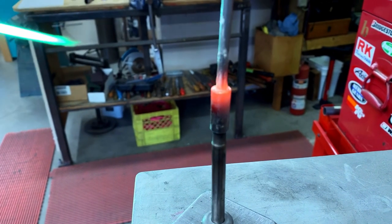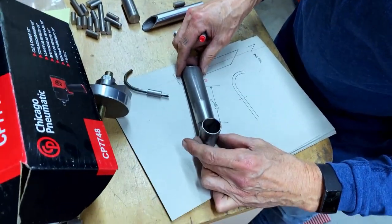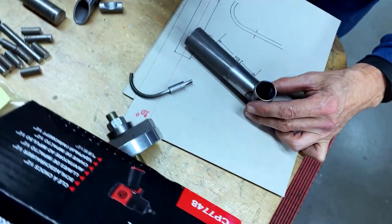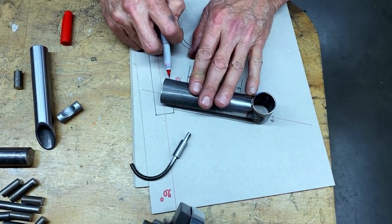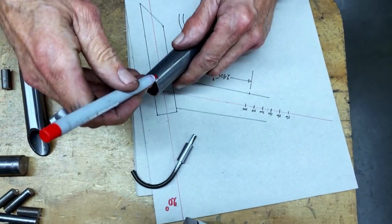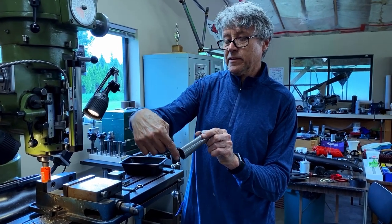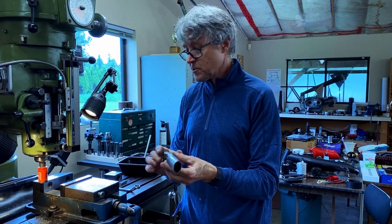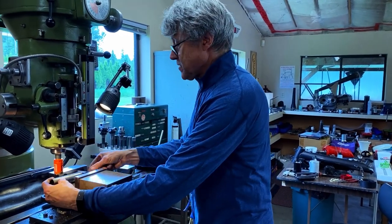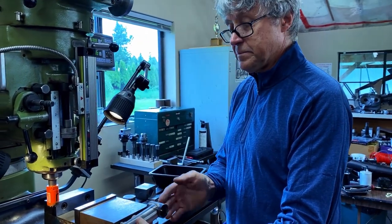And that's it. What I'm going to do is mark it where it needs to be mitered, because when I put that like that I know my angle of 20 degrees. I'll put a mark right here, in line with the front of the quill tube — that's where I want the hole saw to go. So the miter needs to be at a perpendicular angle to the clamp tube. That's partly why this clamp tube gets welded onto the extension tube first, because when I hold this in the vise, these vise jaws are going to hold this perfectly in line with the perpendicular.